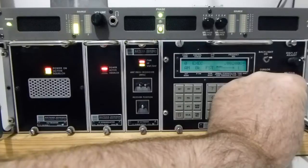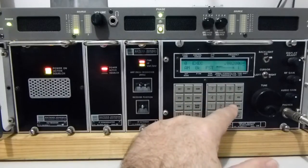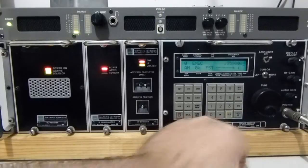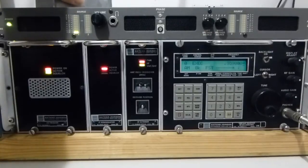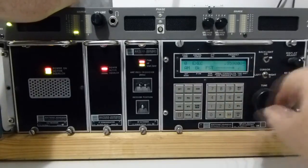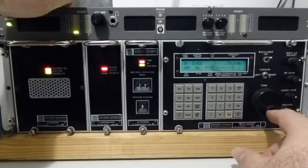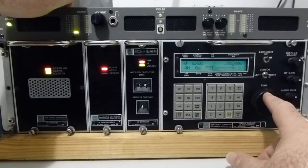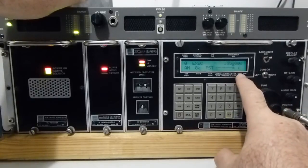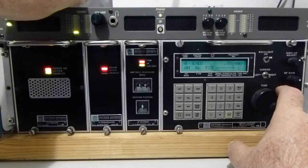As we drop down into that particular band, we can see some of the NDB beacons. I think there's a frequency of 369kHz. I'll just see if we can peak that a little bit. Not particularly strong, but it's on AM 8kHz bandwidth here. There's a little indicator on the display — TuneAFC — which allows you to tune it exactly to the centre of the IF passband. It's useful more on the higher bands than the lower bands.